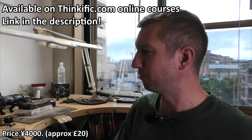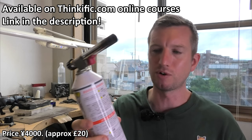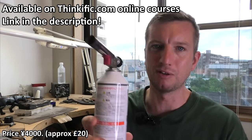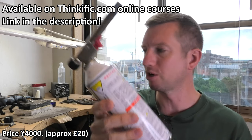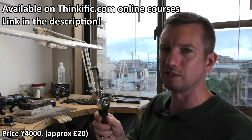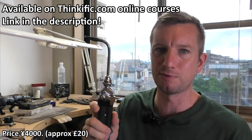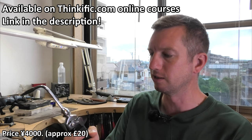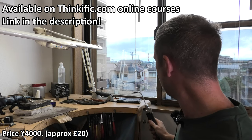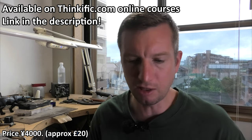You can literally kill yourself and other people. Basic silver soldering — which I used to use, and if you look at my early videos I was using these quite a lot — with a bit of common sense and a sensible attitude, you can get by using that safely. But with oxygen cylinders and gas cylinders — propane or acetylene — you really need to have instructions and know what you're doing to set it up safely, because if things are not connected properly or not in correct condition and you don't even know what you're looking at, it's lethal.